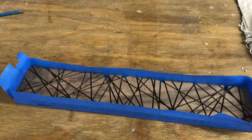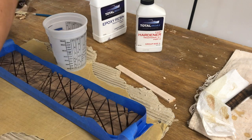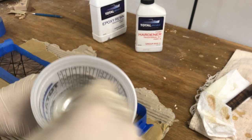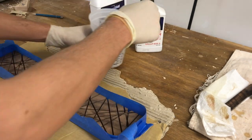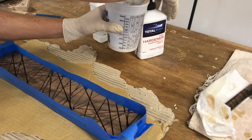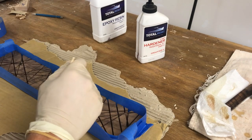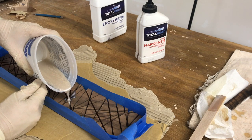With it all taped up, I was ready for the epoxy. I used Total Boat epoxy with Black Diamond Pigments — this color is called Pure Pearl White. I'll leave links in the description to where you can get the items I used. The epoxy I'm using uses calibrated pumps, which makes pouring super simple — there's no guesswork involved. Here I start filling the cracks with the epoxy, doing my best to avoid overflow. You'll see that's a lot easier said than done.